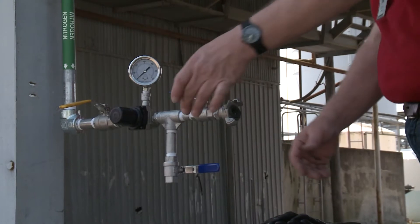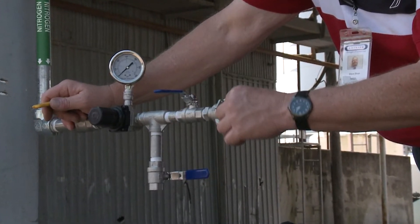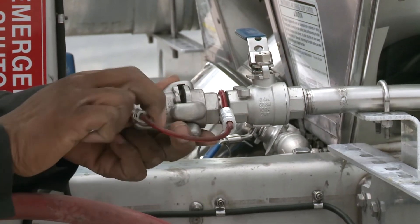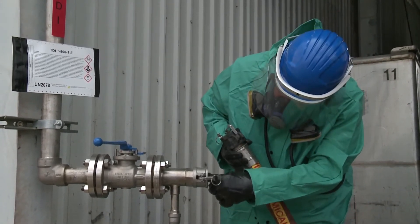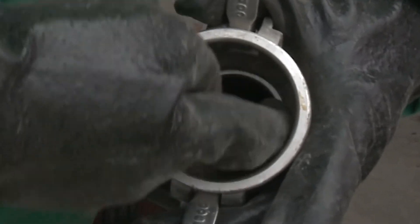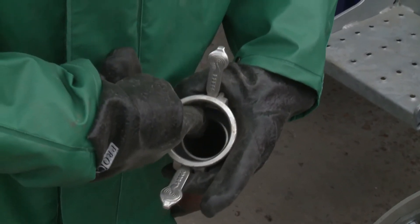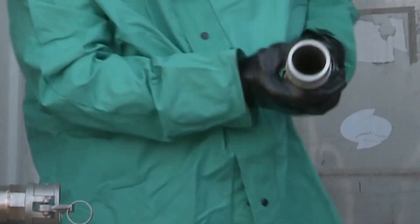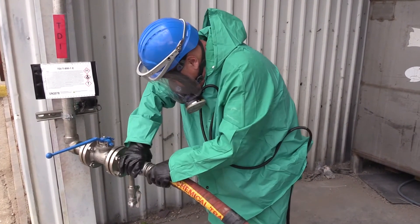Begin the connection process by checking the nitrogen or dry air source. Check the hose gasket for splits or cracks that could prevent a good seal. Make sure the gauge is working properly and that the hose is attached securely. Remove the dust cap from the nitrogen inlet on the cargo tank trailer. Before connecting the product discharge hose, inspect the fitting on the receiving line — verify it is in good working condition. If it is a female fitting, inspect the gasket for splits or cracks that could cause a leak or spill. Replace the gasket if necessary and make sure you dispose of the old one properly. Inspect the unloading hose and make sure the quick disconnect fittings and gaskets are in good working order so that the connection will be secure. If everything is okay with the hoses, gaskets, and fittings, connect the hose to the receiving line and secure it.